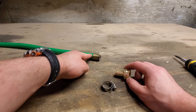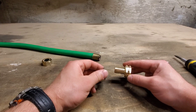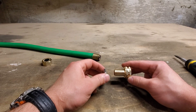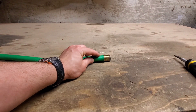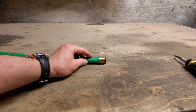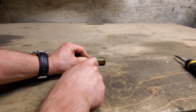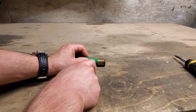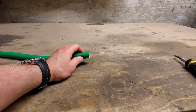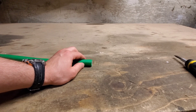The idea is we'll cut the old end off, slide the barb inside, then clamp it on — that should give us a watertight seal. First, we're going to cut the hose. The hose flares out here, so just go a little bit lower. Make sure you have a good blade, because a dull blade will give you a really bad cut. And that is our hose end.